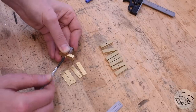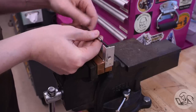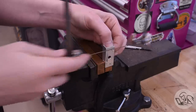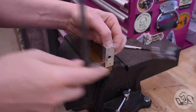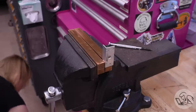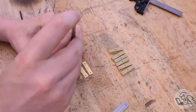Now I can show you how this is going to work. That block we made is used to screw all of the parts to, holding everything in the exact right position. One thing you do a lot when machining scale models is shortening tiny screws. I have an aluminum angle with threaded holes for all the common sizes of tiny screws, and I use a fret saw to shorten them rather than nippers — the saw causes no distortion, and the screw requires no finishing on the end and can be threaded directly into a part. Of course, showing that screw to the camera caused me to drop it, so I had to make that one again. These are the sacrifices one makes as a YouTuber.